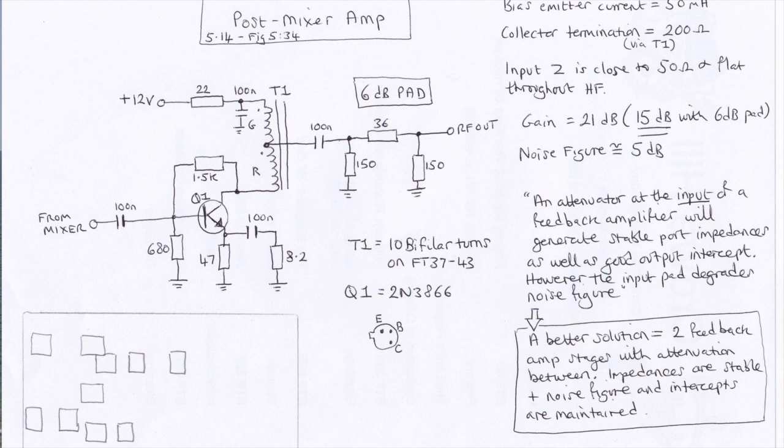So what I did is I drew round the board I'm going to use and designed where I thought I was going to put my little engraved pads, and you'll see more about this in a moment. This is where I'm going to put the components. I didn't even bother drawing them on this time, because it's such a simple circuit. But that's where I'm going to place all the components. Made sure I did a pin out for the transistor. This is looking from the bottom of the transistor up towards the top, as it were, from the bottom looking up.